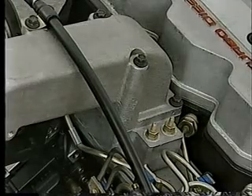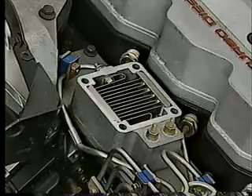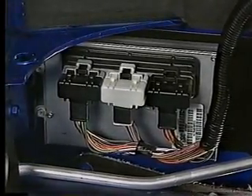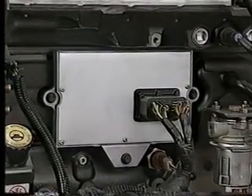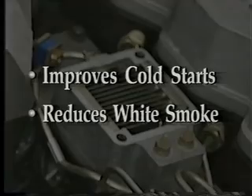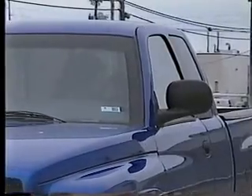There are two intake manifold air heater elements located under the intake plenum. Previously controlled by the Jeep Truck Engine Controller, or JTEC powertrain control module, the intake air heaters are now controlled by the fuel system ECM. The heaters warm intake air, which improves cold starts and helps to reduce white smoke. The heaters operate for a longer cycle time during cold ambient temperatures, and because of this, the ECM also controls the wait-to-start lamp on the vehicle's instrument panel.